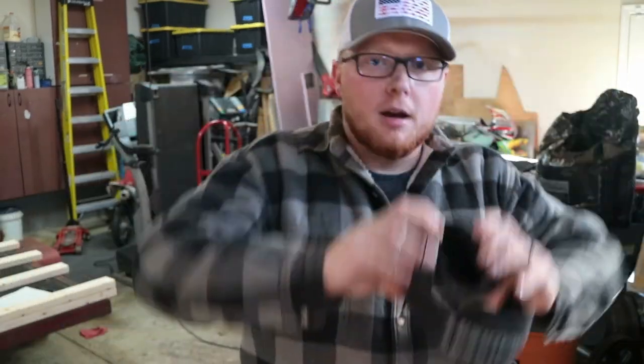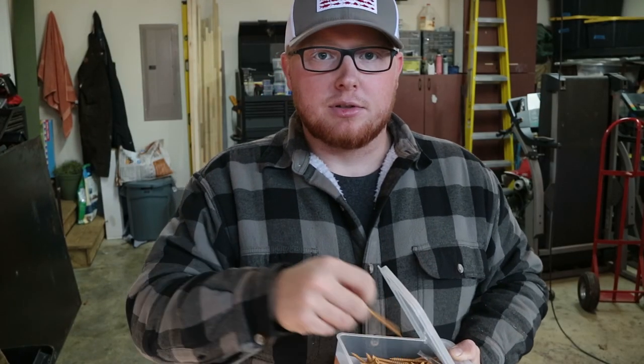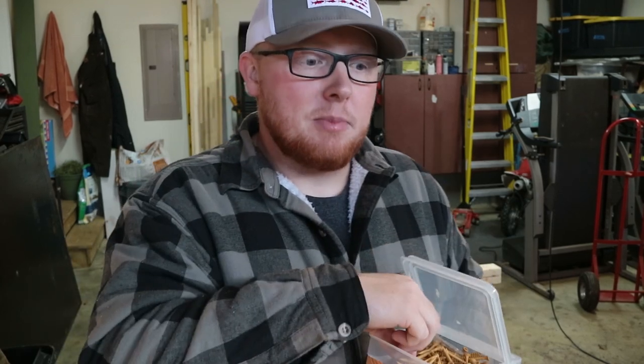That went pretty smoothly — got them all cut out and laid down. One thing to talk about: in most cases when you're framing up any kind of structure you'd use a nailing gun to make it quick. However, since this thing is going to be mobile, I'm going to use screws. After building my deck with screws — there's not a single nail in my deck — I'm really pleased with how they held up over two years. The head of these screws is a Torx bit, and the bits will wear out before the screw head ever does. They're a little more expensive — a five-pound box is about $30, or 25 pounds for around $100.